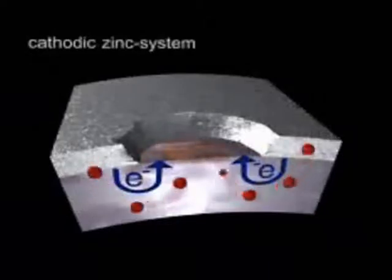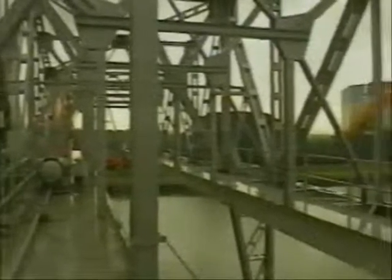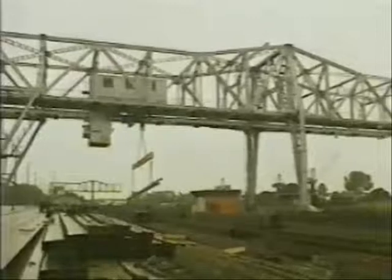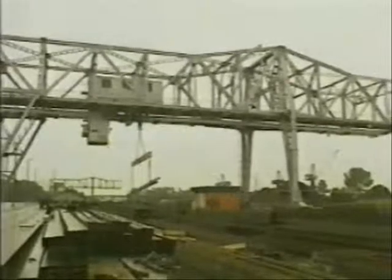When the steel surface is exposed beneath the zinc, the steel is cathodically protected by the sacrificial action of the zinc coating. However, dismantling large structures to be galvanized in this way is often impractical.